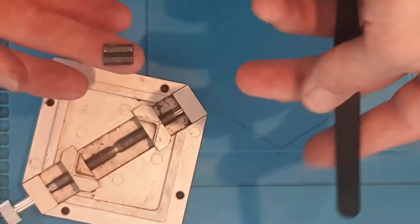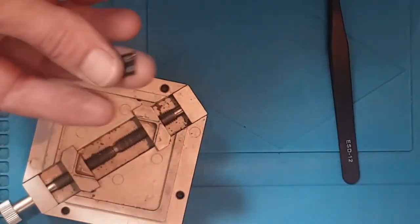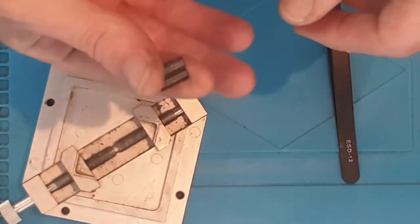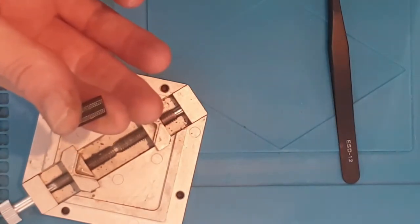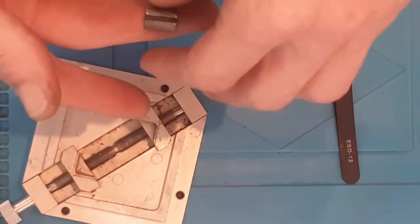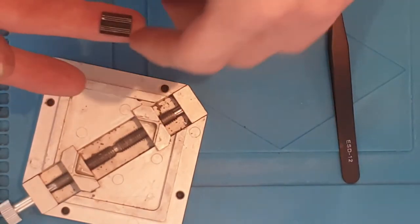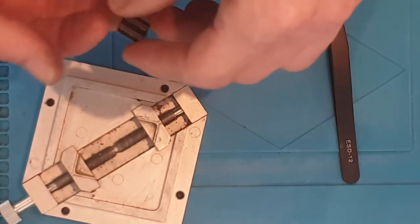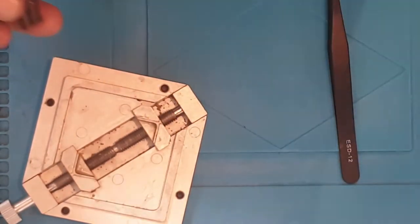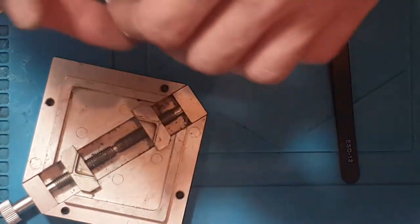400 0.5 millimeter solder balls, or 0.6 millimeter solder balls. I can't remember the exact specs of it, but it would take you forever if you're doing something like that. Or for example, an Xbox One Southbridge, which has 508 solder balls, and I've done those by hand as well, and they're not easy, but it is possible, and that's why I wanted to make this video. But there are so many videos out there where they're just playing some stupid rock music, or some stupid techno music, and they don't give you an explanation as to how it's done. So hopefully we can do that today.